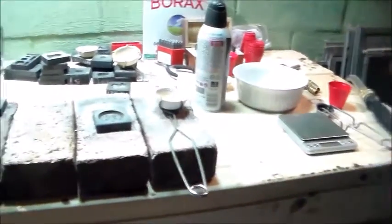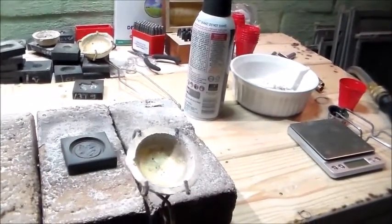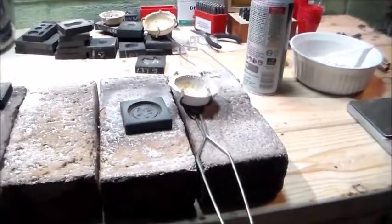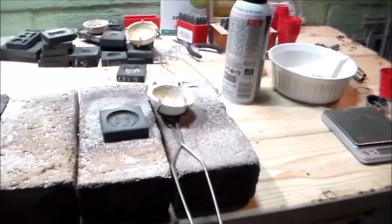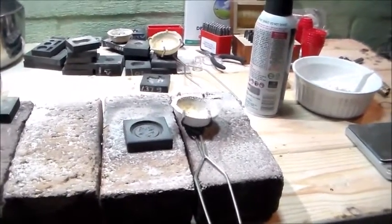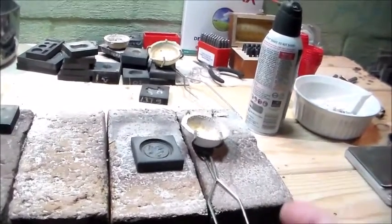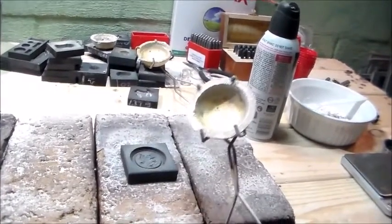The next is how you want to pour. I, of course, use the whip and crucible. I do not use the tabletop kiln. I know a tabletop kiln can go anywhere between $400 and $1,000. I never was interested in doing that, although I am getting a tabletop furnace in that actually looks like an oven, because I've got delicate things that I want to do and I can't do it normally. So I'm going to do it in the furnace, but there are people who love their tabletop kiln, which takes a different type of crucible. It takes an actual graphite crucible. This is a silica ceramic. These come in from China.